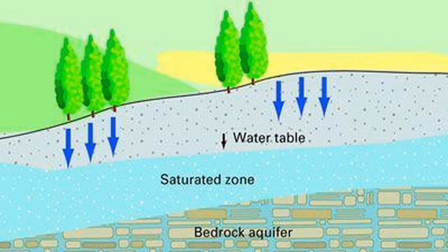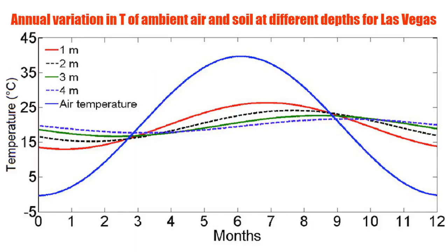And because of the water content, as you go deeper, you have more water content, right? The soil has more water molecules. So because of that, the water creates that steady state, and that explains the huge difference when we measure the water, I mean the soil, right? The water molecules in the soil versus the air, right? So as we can see, the water content in the soil actually stabilizes the temperature of the soil.